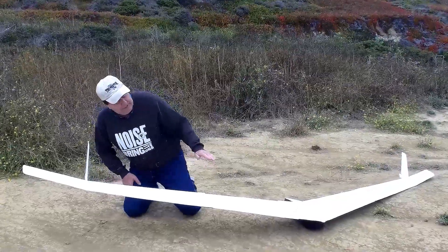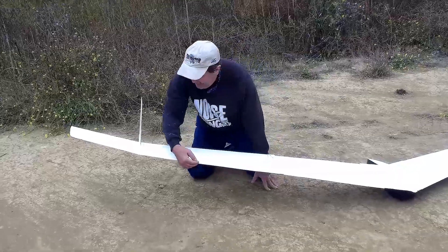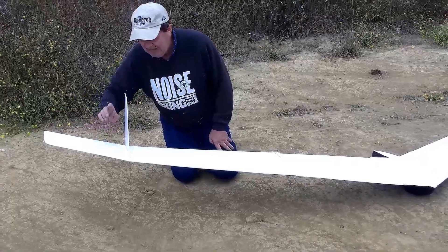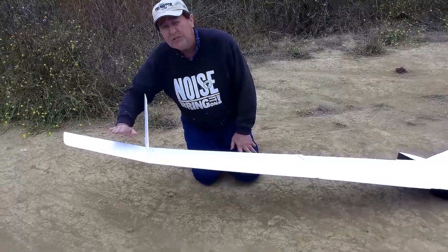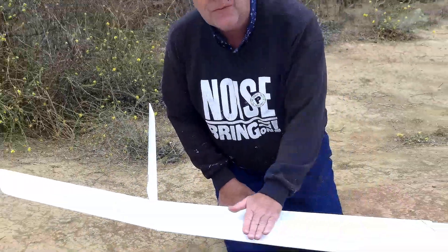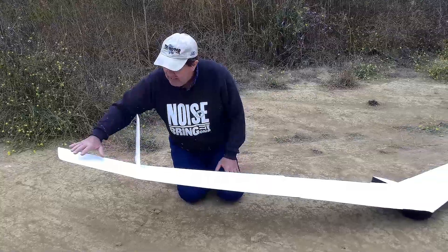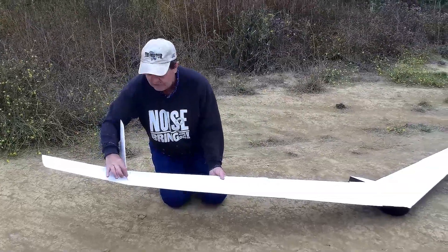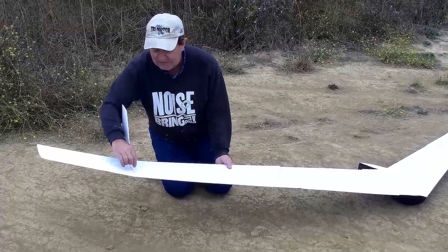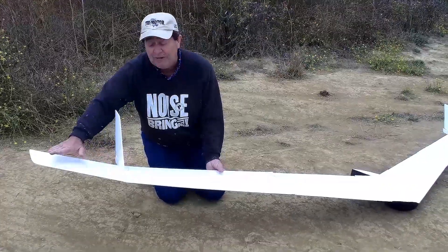I've also changed the design so that the wing is flat or straight along the leading edge — no dihedral in the center section — and then all the dihedral is out here at the tips, five degrees worth of dihedral. The reason for that is that dihedral is really most effective out at the wingtips, so might as well put it all out here. The other big factor is it's much easier to build a wing that's flat than one that has a very slight slope to it, which is difficult to build accurately. The five-degree dihedral will be set here in the field joint. The pin that goes in to attach the wingtip to the center section will be built such that the five degrees of dihedral is right in that fitting. So when this portion of the wing goes on and we drop the pin in, we've got our five degrees of dihedral.